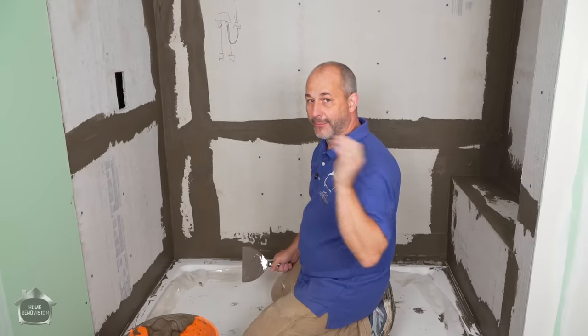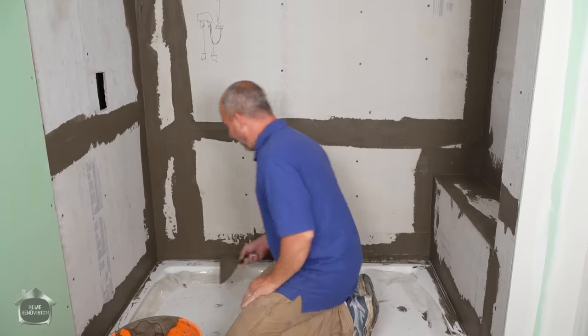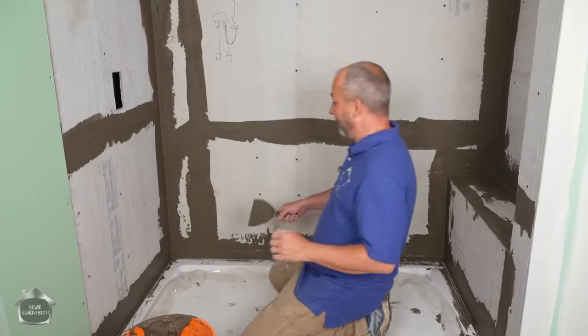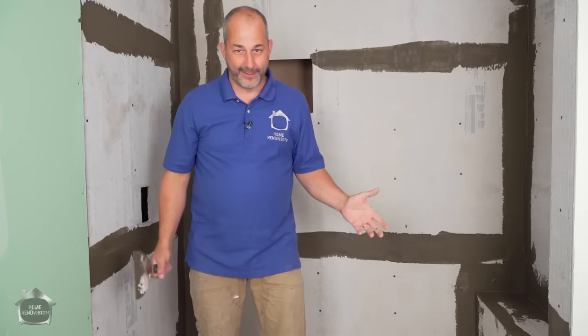big deal. When you're in here, the wiring is set, the fan will be on with the lights, and it's guaranteed to evacuate all of the moisture in this room. So again, to what degree you want to prep yourself for what kind of longevity is up to you. But if you use cement board and you seal the joints and you use a waterproofing membrane system, most shower systems with a decent fan in the room, you're looking at a 50 to 75 year shower. Not going to be a worry. And I'm more than happy with that.